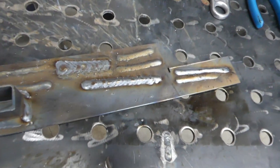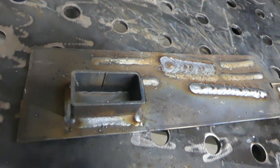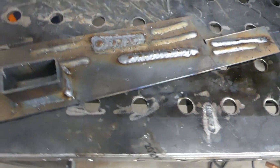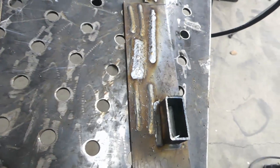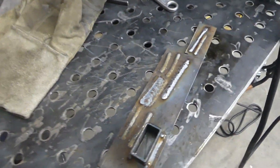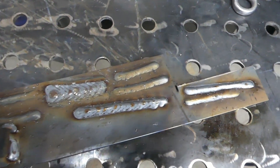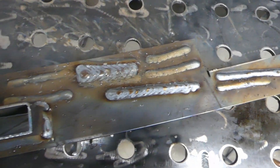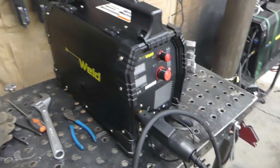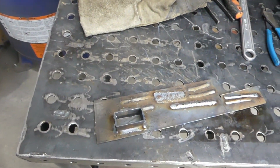After a little more playing with it, the welds don't look too bad. I used their suggested settings and kind of went from there - I might keep tweaking. I was running pretty low on gas and that's pure CO2, so 75/25 mix would probably make a nicer weld, but not too bad overall. Good so far - we'll keep playing with it and see what we can come up with. I think it will work pretty well.